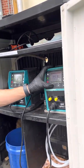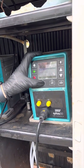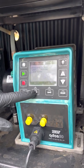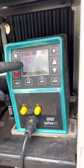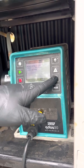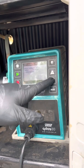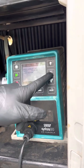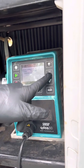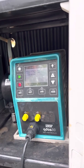When I come over to calibrate my pump, I'm going to hit menu, go to mode, and take it down to flow calibration — which is one click. I go into flow calibration. I know I need to hit 208.9 mils per minute, so I'm going to turn the RPMs down until the mils per minute read 208. I click it a few times and get it to 208.75 roughly, then I hit enter.